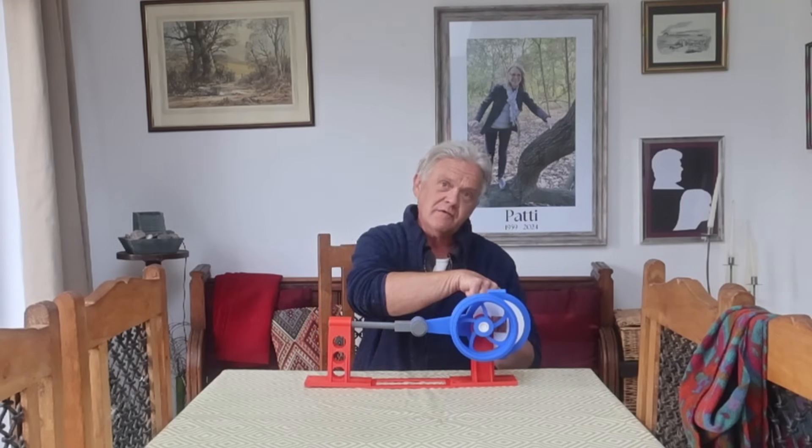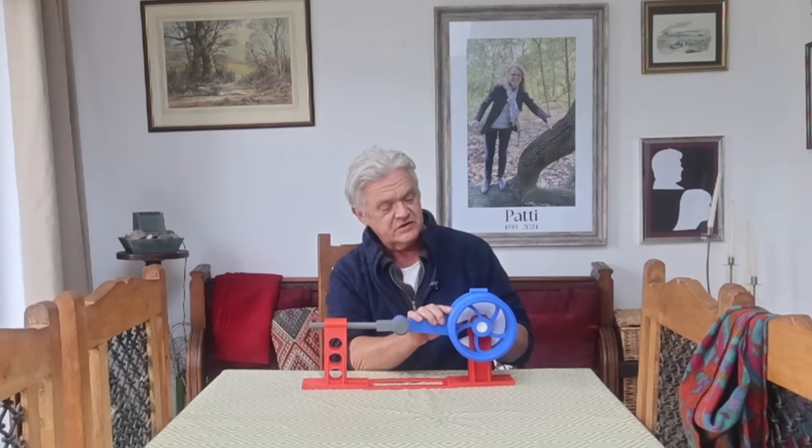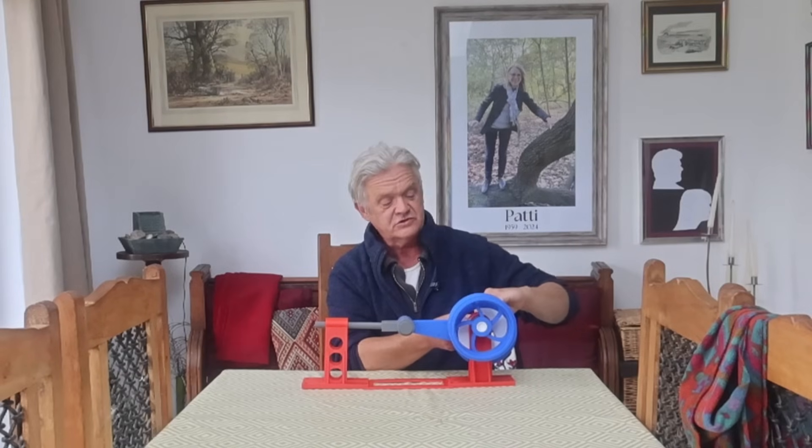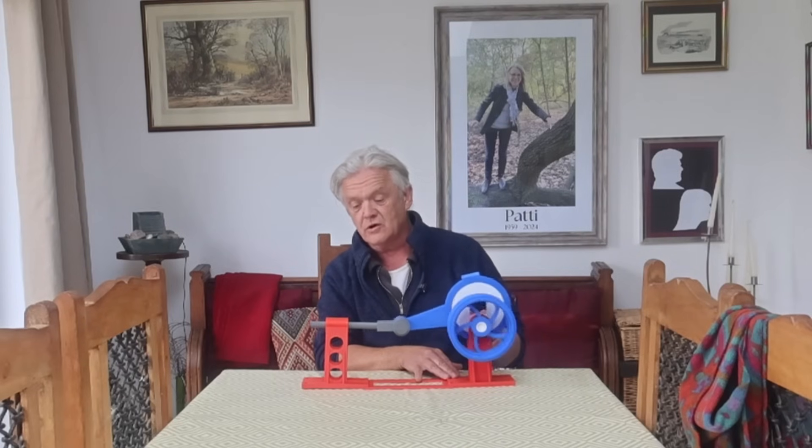With the inner axle twiddled around so that the slide is at the top, when we turn the flywheel — or we can also turn the axle on that side — we get the longest amount of travel, because the centre is furthest away from the eccentric. But if we twiddle that down so it's now sitting right at the centre, then when we turn the flywheel, we get no movement at all. So we can go from no movement to any kind of movement in between to change the length of that throw. Set about halfway, we get about half the throw; set at full, we get the longest distance. So what we've got here is a variable piston.